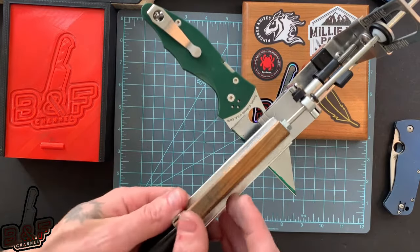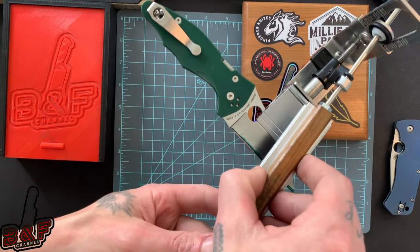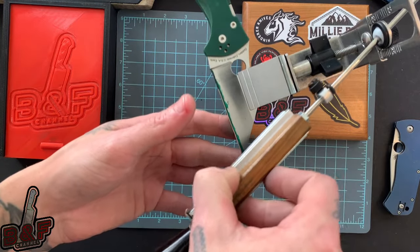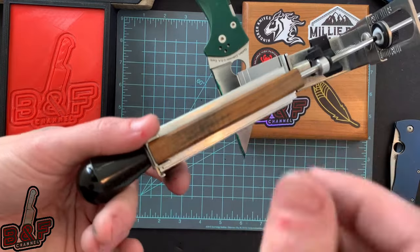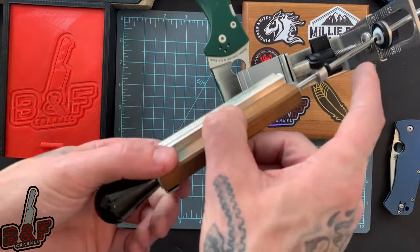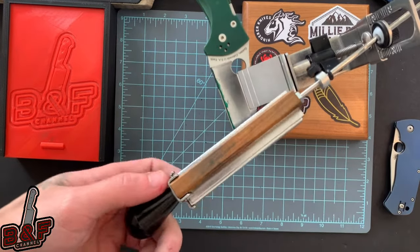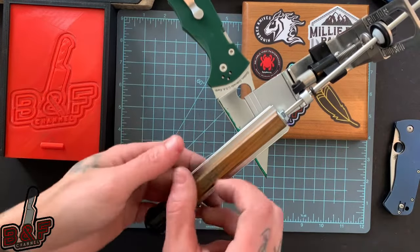So when I'm coming over near this tip, I was holding it like this. But then I'm going to hold it on top of here. And if you have a nice tight pinch on this, it can't twist off of your edge like that. You want to hold it so it cannot turn. So that's why I'm pinching it hard. See, if I pinch it loose, it can turn and roll off easy. If I pinch it nice and hard, it is much more difficult for me to roll off the edge. That's a little tip and trick that can be very useful sometimes.